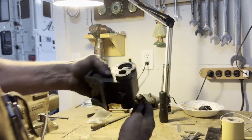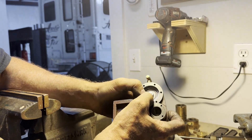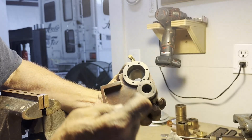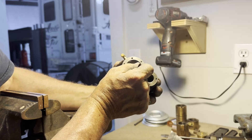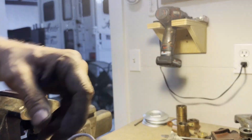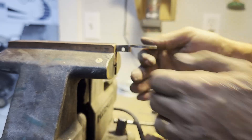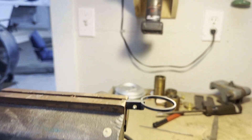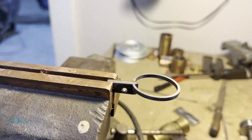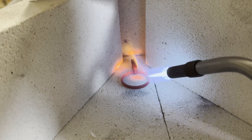It works, you just have to take your time — it takes about five minutes. Then you want to set the ring gap. I've got the ring sitting at the front of the cylinder and the piston is behind it, using the piston to square the ring up. You want that gap to be three thousandths of an inch on this particular bore. I'm using a feeler gauge making sure the gap is right — I had to hit it a few times with the file to get it set to three thousandths. Once that's correct, I grabbed a scrap piece of steel and machined it down to two hundred thousandths in width, which is fifteen percent of the diameter of my ring, to use as a spacer. We're going to heat treat the ring so that we have spring tension outward in it.